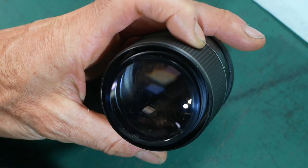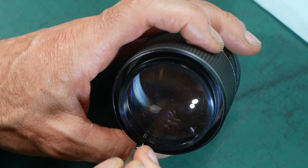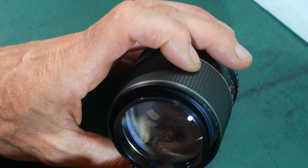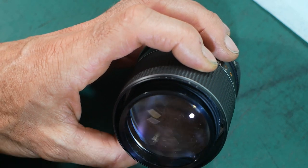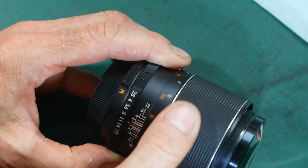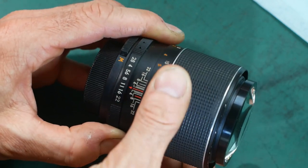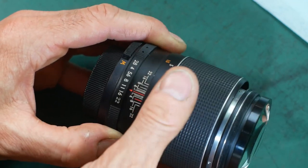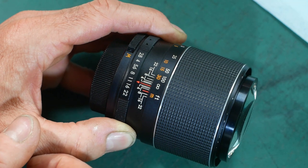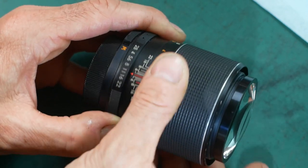So now I'll just do up the three screws. They don't want to be mega tight, just enough to lock them up. They're pretty small screws so just not too tight at all, and it's taken many years for them to work loose in the first place. That's all three done. With a bit of luck we should be able to go from infinity through to the minimum distance and back again — no slipping at all, so that's absolutely perfect. As long as I've got the full travel and there's no backlash, that's job done.